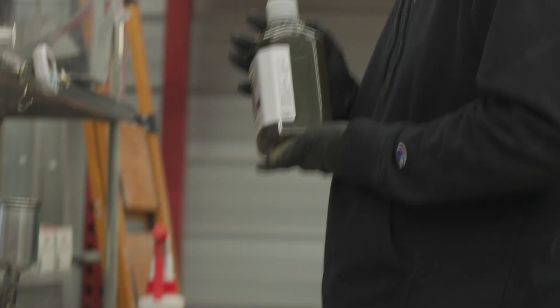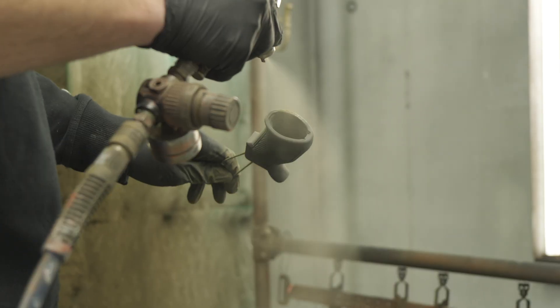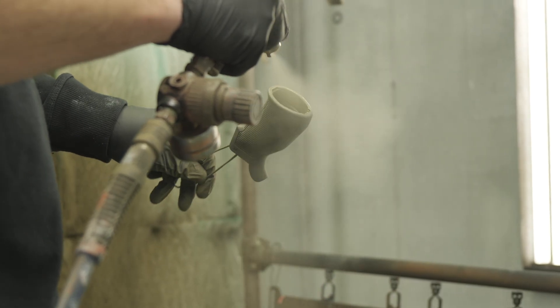We have a nice room with good filters in here. Jacob takes the utmost care in mixing and weighing his catalyst and cerakote. Throughout the years of spraying production parts — particularly driven arms where aesthetics are very important — we've figured out that for best color accuracy we don't dye the parts before spraying FDE. Small steps like that lead to positive visual changes. As we tell all our customers: quality is key. We're not after the lowest cost, we're after the best.